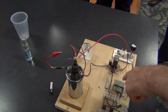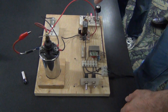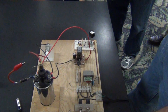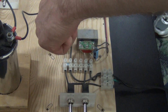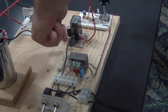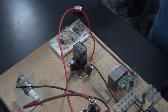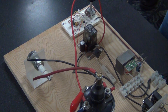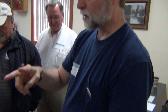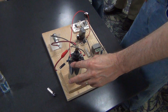The power comes in and is divided into two things: a little step-down supply to run a 555 timer that flips the relay, and a second section that takes the power through a 100-ohm resistor and a full-wave bridge diode and drops it on one end of the relay, which then charges the capacitor to 160 volts DC — rectified 120. The capacitor's on the wipers, so it's complete isolation. It can either touch the supply and get charged, then disconnect, and then drop the capacitor across the primary of the coil.